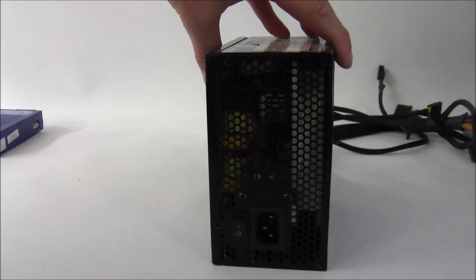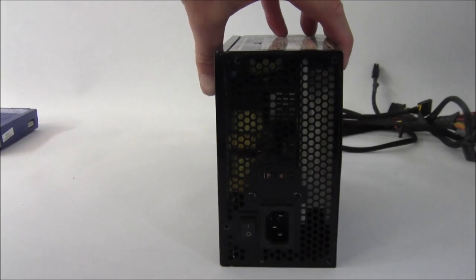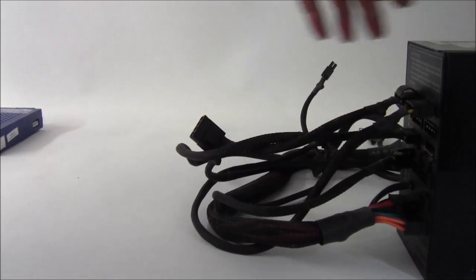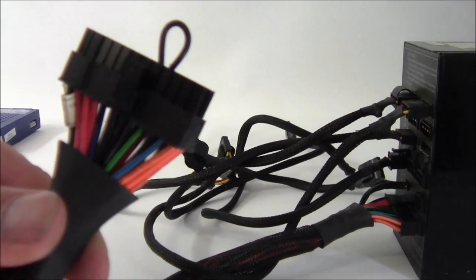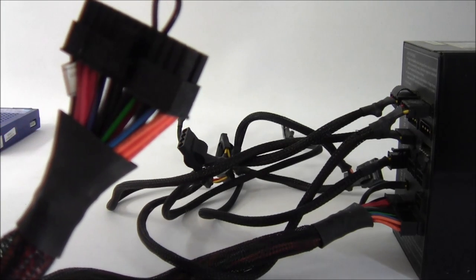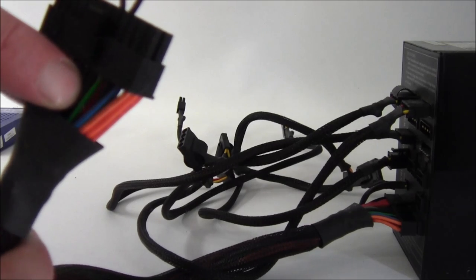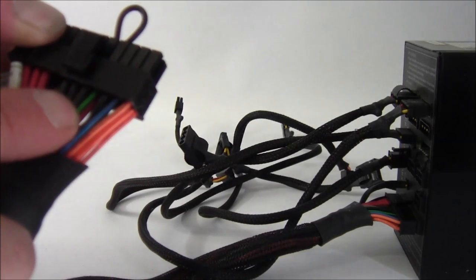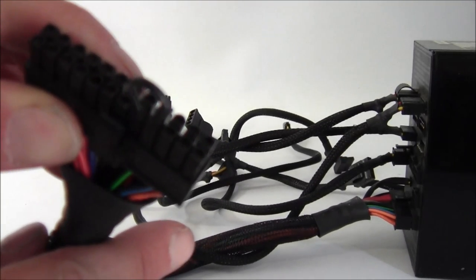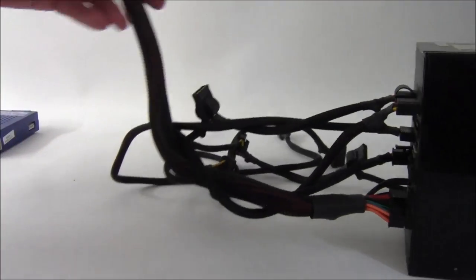Then we have a PC power supply. This is a normal power supply you find in a PC. The only difference is when you plug this straight in nothing will happen — it won't turn on, as it normally relies on the motherboard to be switched on. So you have to do a slight modification to the connector that normally goes into the motherboard. You can see the green wire — it's got a small bit of wire acting as a jumper going into the ground wire next to it. If you're going to use a power supply just for this, you can pull the wires out, solder them together, and put heat shrink over them, or just put a small bit of wire at the top like that so it acts as a jumper. When you turn it on the PC power supply will turn on, and you just turn it off from the plug socket.